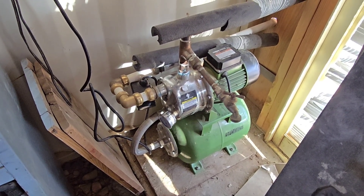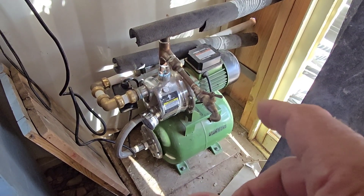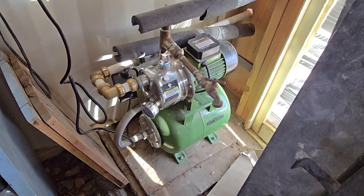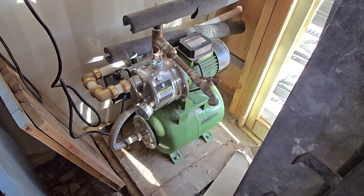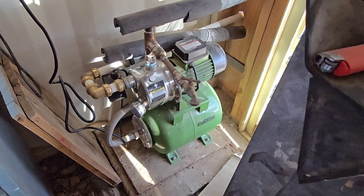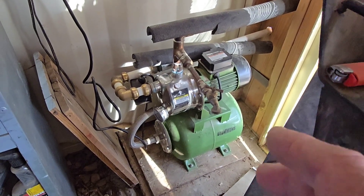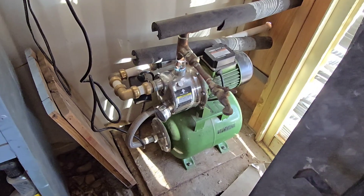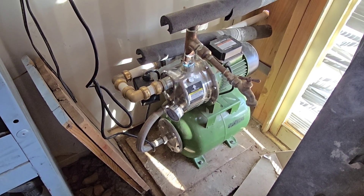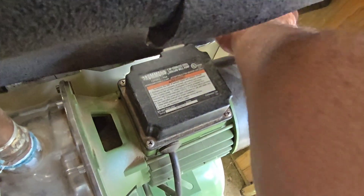Those points are very important for your Drummond shallow well pump. I've got two of these because I thought the bladder had gone bad on my first one, but I learned by disassembling it that that's not the case. The bladders on these are really heavy-duty rubber and they don't go bad unless you mistreat them — over-inflate or under-inflate the tank. If it's set right, it will give you 45 PSI of water pressure at your house or cabin. If you're going higher than that, you didn't set something right.